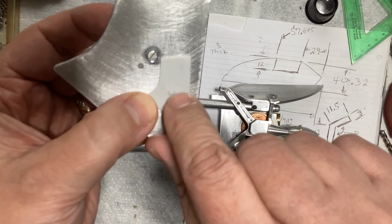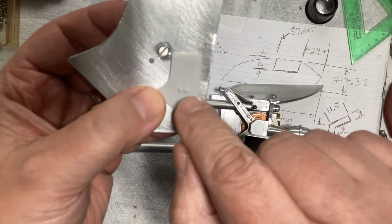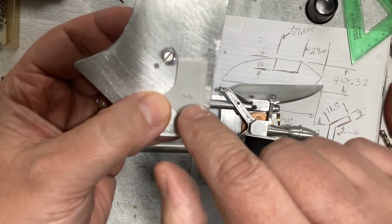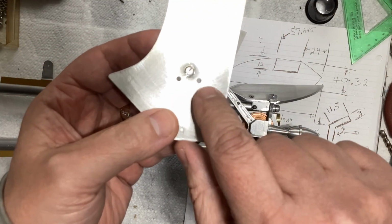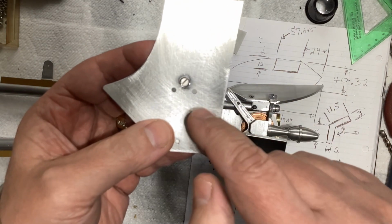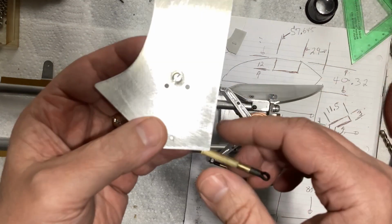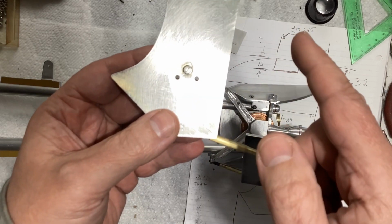So I need to make a round thing with a triangle thing sticking up from it, and for scale, they would be about 7 millimeters in diameter. And I think I'm going to make those out of brass, and I just put the holes there to locate them where they're going to go. Not sure if I'm going to screw them from the backside or just JB weld them on. Not really sure. Haven't figured that out yet. Those will probably be done in a next video.